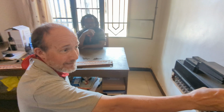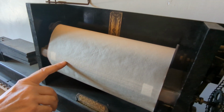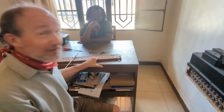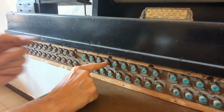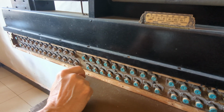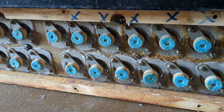If you have no holes in the paper roll, you have vacuum on each side of the membrane. It's inactive, but as soon as you have a hole punched in the paper roll, you have atmospheric pressure pushing the membrane that pushes the valve, opening a little channel towards the bellows, which is emptied of its air by the vacuum reigning inside the machinery. It's like a domino effect.